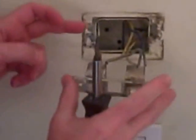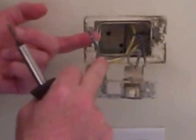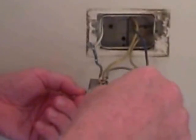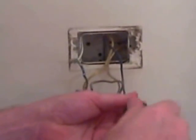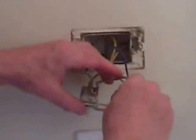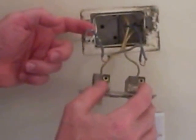I'm going to remove the screws from the top of these switches and take the screw completely out, which will expose the wire and keep it in that shape so I don't have to try to force it out. I'm going to take the wires off the top of the switch and then do the same on the bottom. I used the tester to make sure the circuit was truly off. You can see how instead of just one wire coming in and feeding both single-pole switches, it actually goes on to another circuit — they just stripped the insulation off right here.